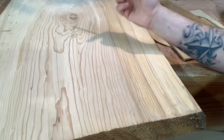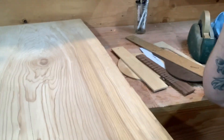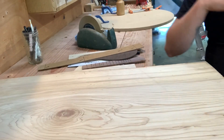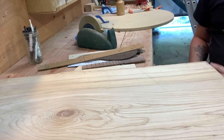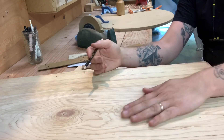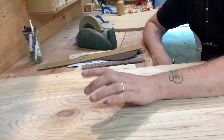This is way more wood than I'll need for one instrument. I might use the rest for hemlock necks — I love hemlock for necks on a ukulele. The wood grain goes like this through the tree. This is a center slice, so at the edges it mimics quarter sawn wood by maybe off by 15 degrees, and in the middle it's flat sawn. I think I want to make everything out of hemlock except for decorative trim.